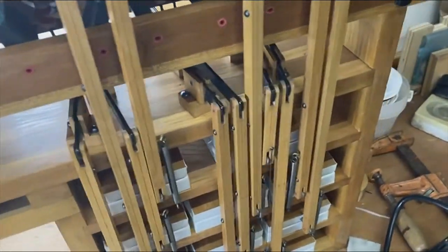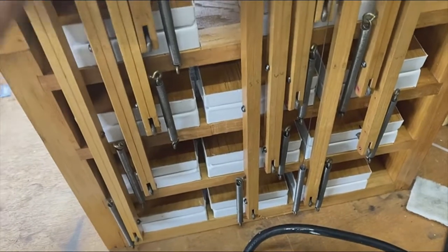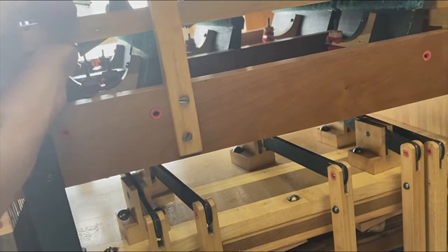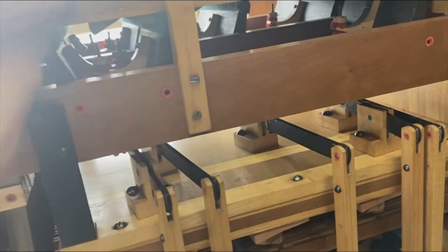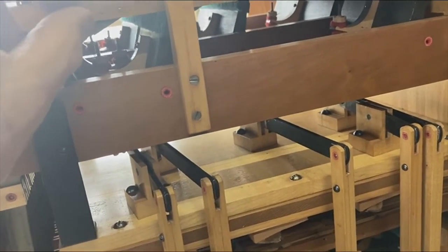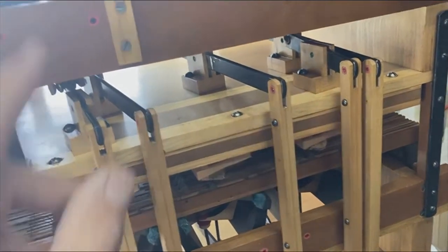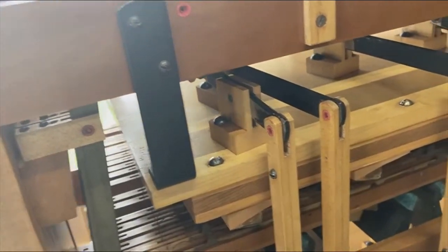Here's one of the combination system actions. This has all been rebuilt — you can see all the new leather that's been put on. This is set up to hook to the draw knobs. It has little cams, and the cams are set one way or the other depending on whether the stop's in the on or off position. There's a swinger unit underneath fired by pneumatics that picks up that particular stop if it's been set on and turns the stop on.